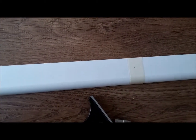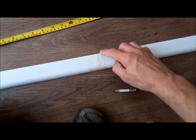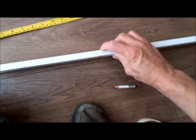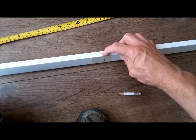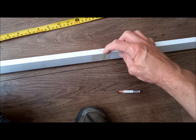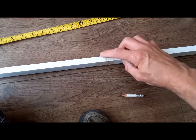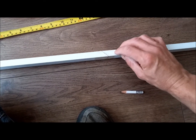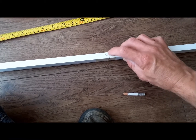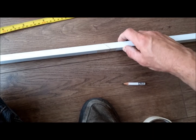I'm now going to put a square line across there, and that will be my cutting line. I've marked my square line and also marked the wastage. When you turn it up, you can see I've marked the 45-degree cut and the wastage. Remember to make sure that the 45-degree moves away from the outer edge. When I cut there, the next cut I will have to do on this architrave will be 45 the other way, so that when these meet up they make a perfect right angle. I'm now going to go and set up my chop saw.